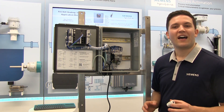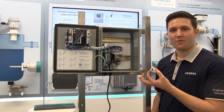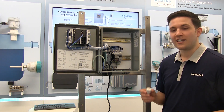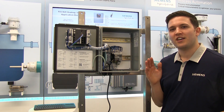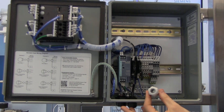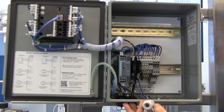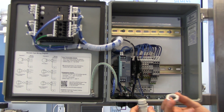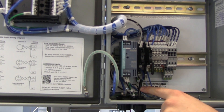You'll notice that you have five cable glands in the unit when you receive it. Three of them are single cable glands, used for the power connection and the two channels of flow meters, and two of them are dual cable glands, used for the two channels of dual temperature transmitters. Take the single cable gland and connect it to the open hole now available for the power cord. Use the plastic washer included to secure it on either side, then wire the power cord through the gland.